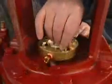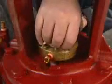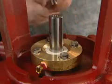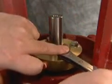Place the gland plate bolts into the plate, tightening them just hand tight for the moment. It's critical for proper seating of the seal that these bolts are tightened evenly. Using a nine-sixteenth inch wrench in a diagonal pattern, tighten each bolt a few turns at a time. Repeat the pattern until all the bolts have been completely tightened. Whatever you do, don't over-tighten these bolts — seriously over-tightening them will strip the threads on a cast iron casing and that's a very costly repair.